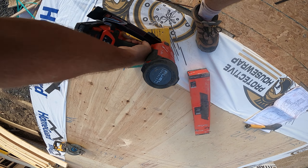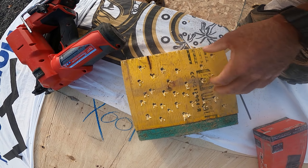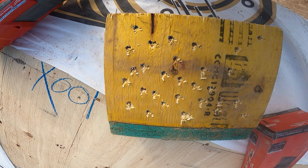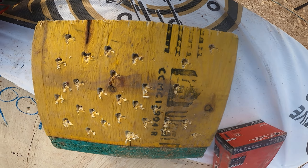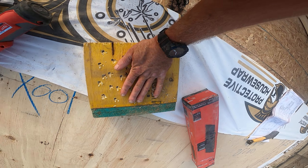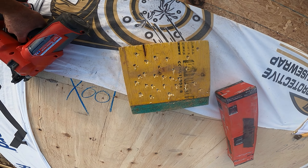As you can see, this is double LVL and it buried every single nail. I mean buried — you have to dig just to see the head. There's no debating the power; the power is there. You can see the bump fire, and it's got that six-nail lockout feature as well.